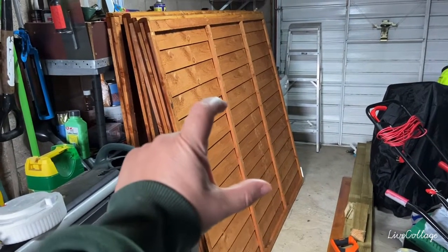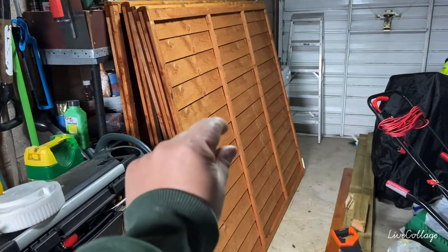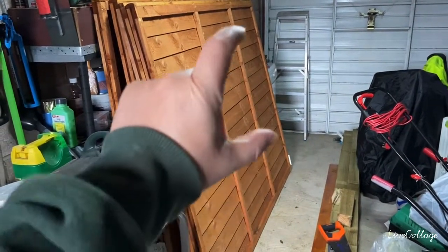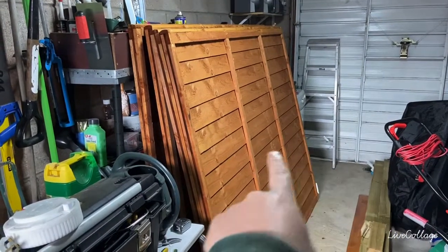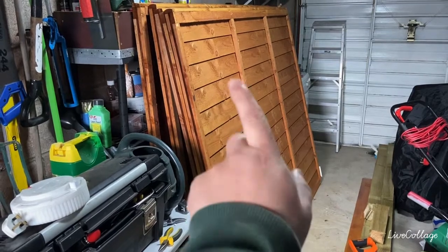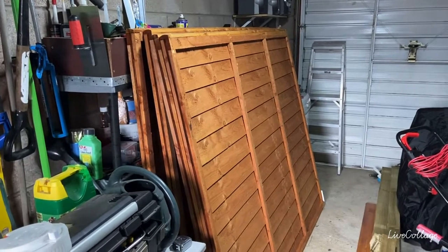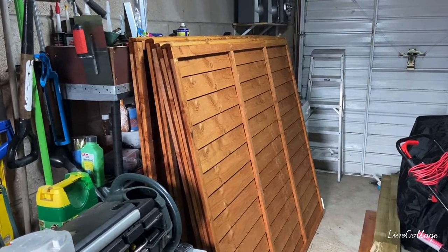Now usually you would use a smaller panel because it's more pleasing on the eye, still to be able to see the coping stone. So you'd fix your post to the wall, then the small panel above. Now I did originally order 6x4, but they've blooming delivered 6x5, so I'm not too fussed, but it's another foot to play with. It doesn't matter, I might just bring them down the wall. I'm not too bothered, like.